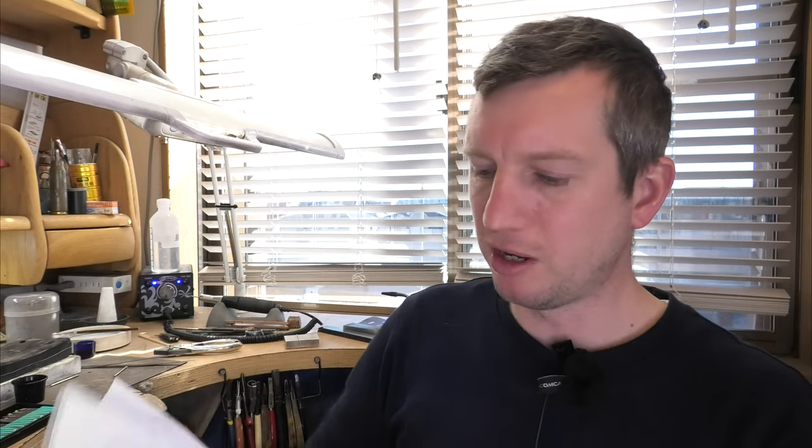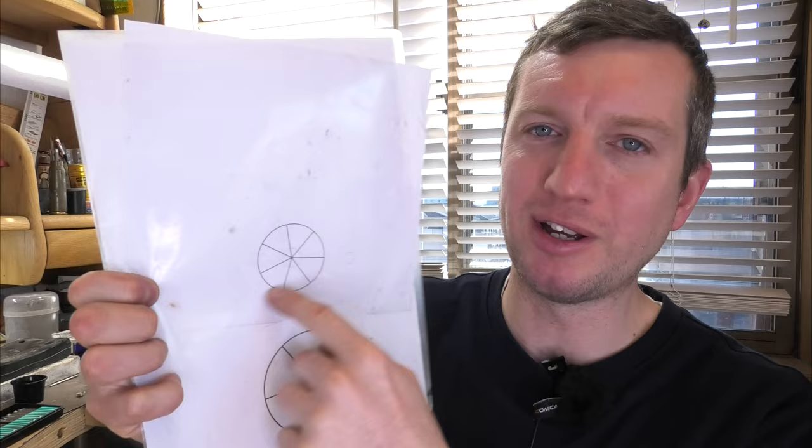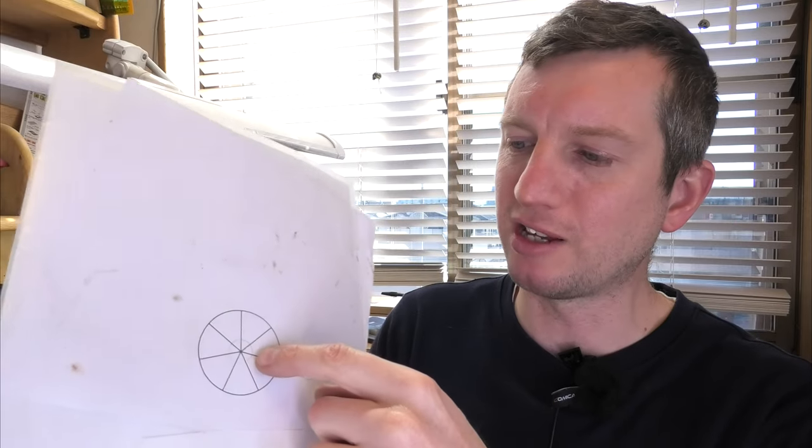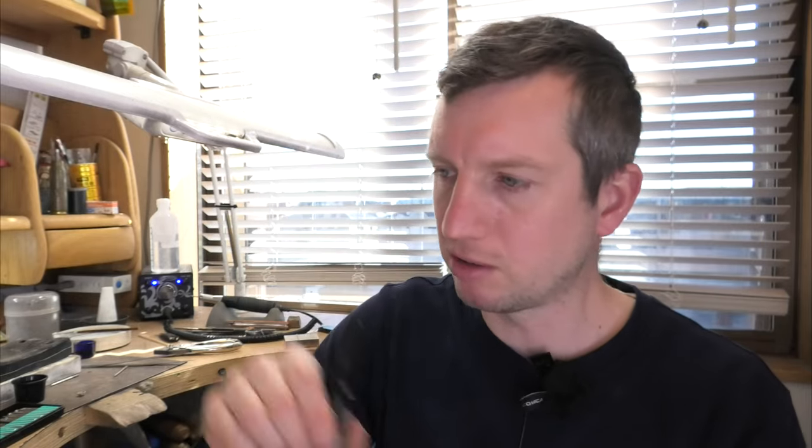This is just me trying to find things from other trades that are useful to me as a jeweler. Otherwise I'd do it the old-fashioned way — like when I started my career, it was pre-internet, so you'd literally get a compass and try to work out the degrees of a circle and draw that out. Now you just Google 'circle divided by however many claws you want' and get images. I recently did this for a seven-sided stone — quite tricky. I printed it out, drew a smaller circle around the center to help line up my collet, then used a fine liner pen to just draw them out. But it's very nice to have a metal tool to just hold your piece in position and carelessly mark things out perfectly.